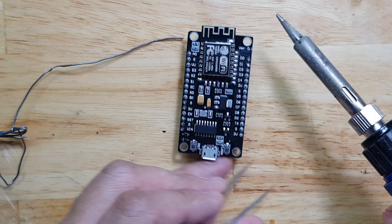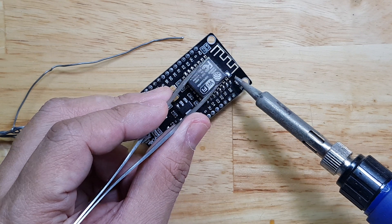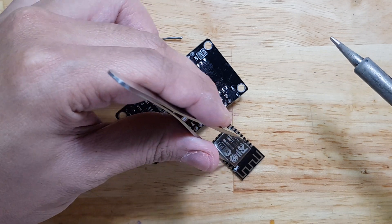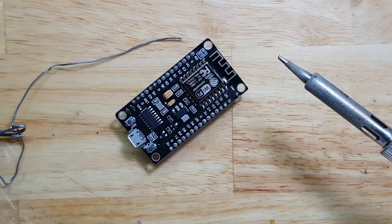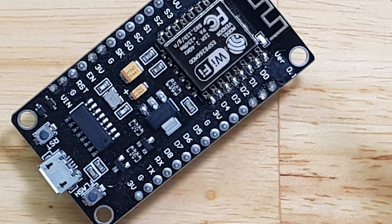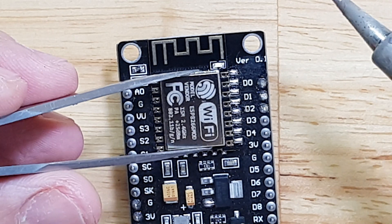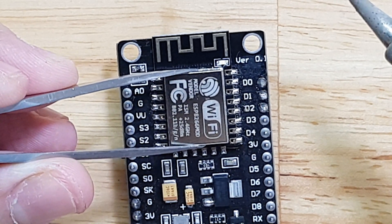So what I mean is we need to select one point. I will select this one, this point here — I will solder the pin there. Here's the tweezer. Let's put it back there again. Let's zoom in a little bit so you can see it. We will solder this part here, but make sure you center it first on both sides and on the bottom.